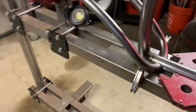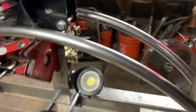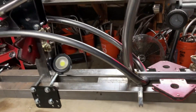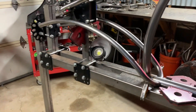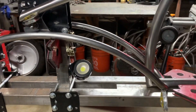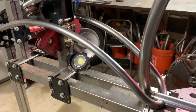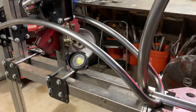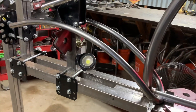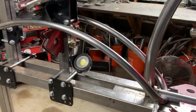We got the new piece in and coped, looking good. Going to cut the end and not too short this time. One of the hardest parts about doing this again is getting the radius the same — that's why I was not happy last night, as doing these compound bends, re-rolling and re-bending to get it to match is not an easy task. Normally you are working with one piece of steel, rolling it longer than you need, cutting it in half, and then you've got matching ends. In this case I had to do a single stay to match an existing stay, and I pulled it off, but it's a headache. Anyhow, moving on — let's cut this off, cap it and get it done.